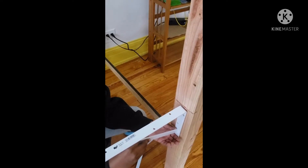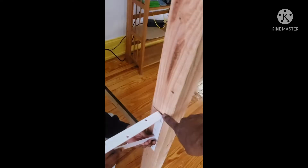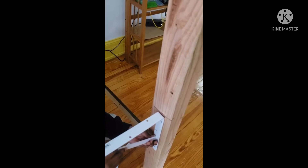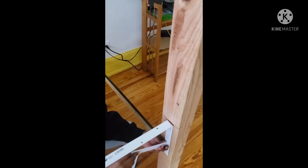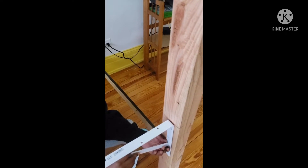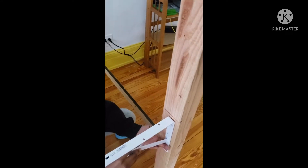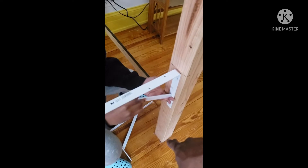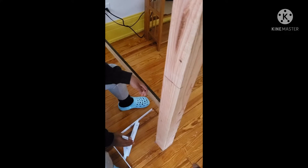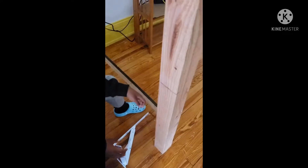You're going to put it like that, right up to your line. When you get to the other side, it's going to be right up to the line too. That should give you your level — it should be level when you go across. You can put a level on it later, but we measured 30 inches up off the pole. The pole should be the same. This is a factory edge at the bottom — the factory cut should be good. Don't rely on it, but it should be.